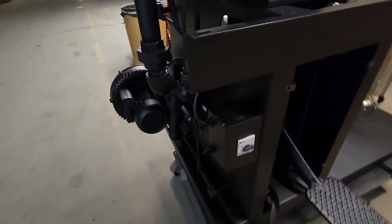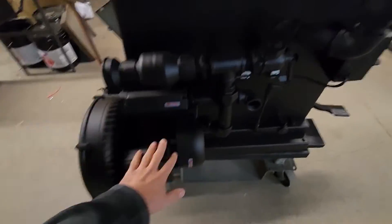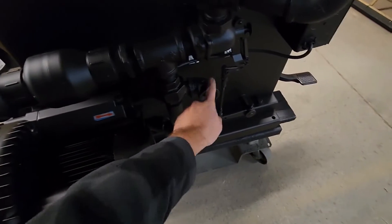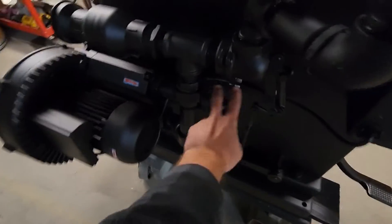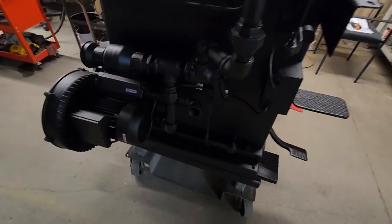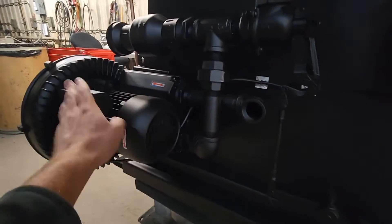Once you're at 80 pounds and the heating light is stable, you can start using the machine. The first thing to do is turn the vacuum on. The blower assembly will suck air from the buck when the buck valve is open, or from this check valve when it's closed, and push it out through this tube. Our recommendation is that this discharge gets plumbed into a different room, outside, or somewhere away from the machine — it will be extremely loud, extremely hot, and there will be moisture in the air. We do offer mufflers, but we don't recommend them as a first option because they dampen the blower's performance.